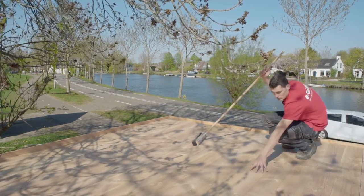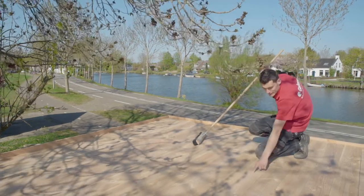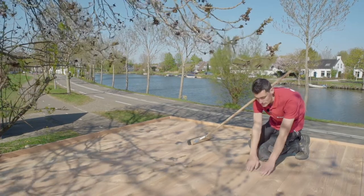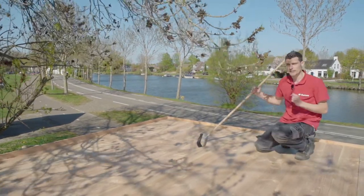Here's another tip. When fixing the roofing boards in place, use at least two nails at every joint between the rafters and the boards. A single nail to the center of the board encourages the buckling process. The sides will rise up and the result will be a lumpy bumpy surface under your EPDM film.